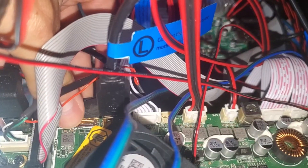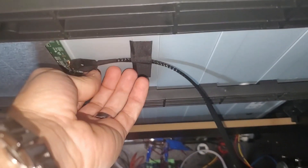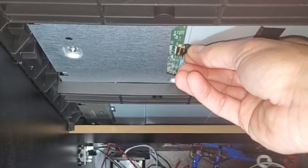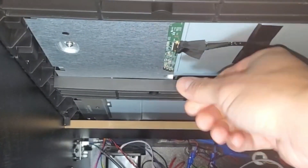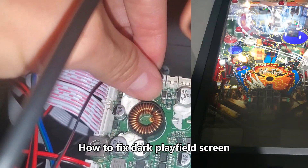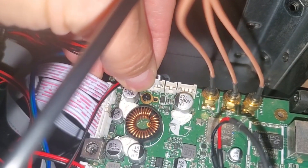The latch should flip over and snap down. Reseat the cable connection — it should snap down just like that on the motherboard. Reseating this cable connection might actually fix the backlight issue. Reseat that connection by pinching this tab and reseating to see if that fixes your issue.